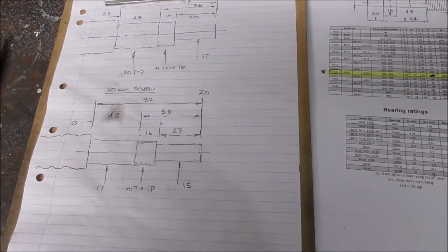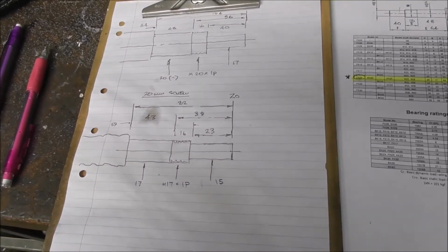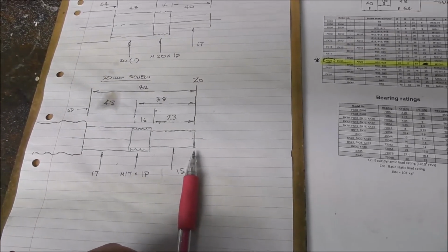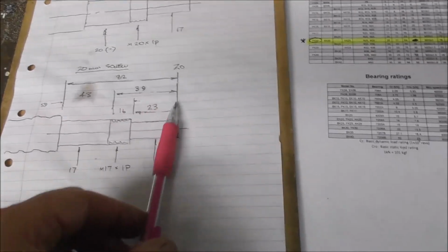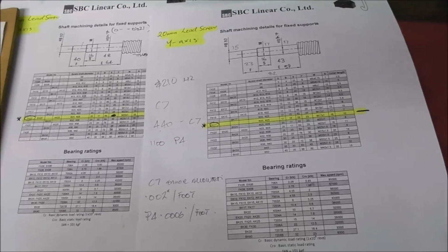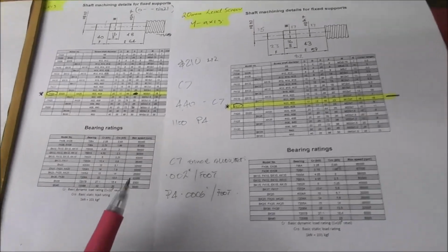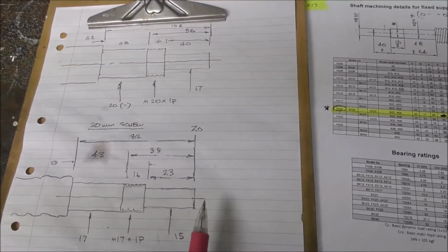It's really worth your while taking your time before you start to make machinist-friendly drawings. What do you call them in the States? Blueprints or plans or something? But anyway, drawings, dimension drawings that represent the work from a machinist point of view. That is all the dimensions from Z0 being the end of the work, and dimensioned that way from that datum, and all the diameters nice and convenient, because what you will get from the customer usually, or even a CAD modeler printing off a PDF, will usually be from the wrong datums, and you can easily get confused and make a mistake.